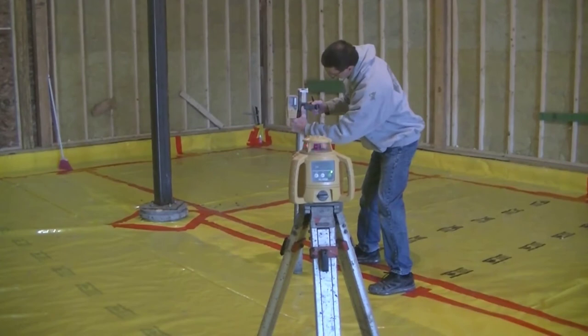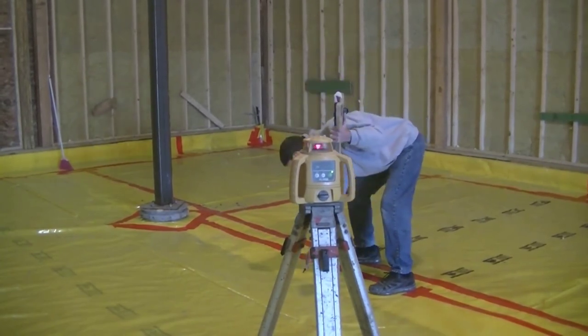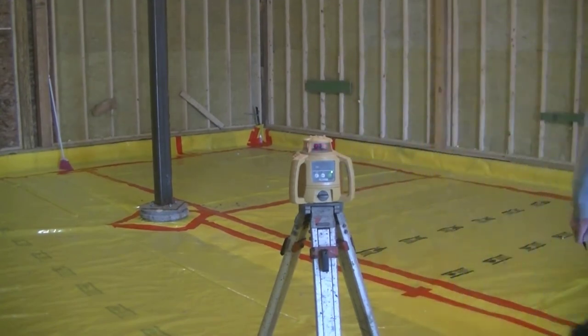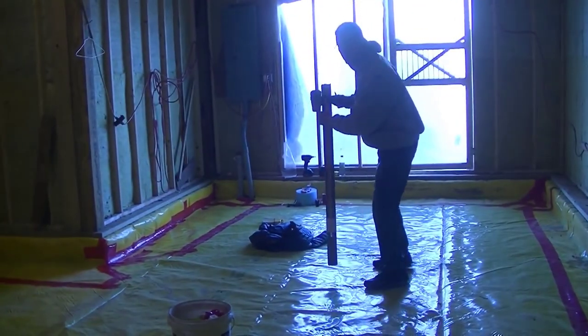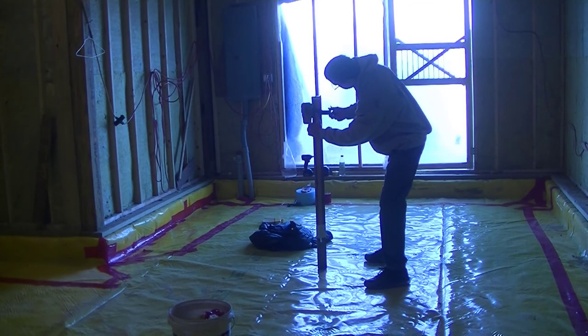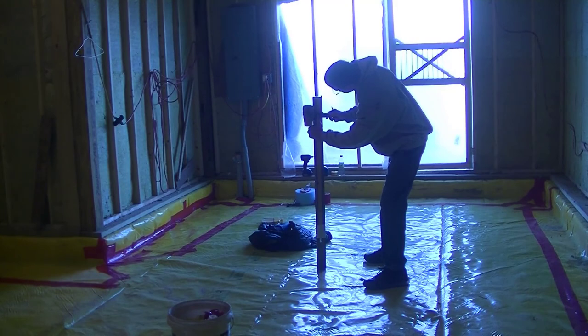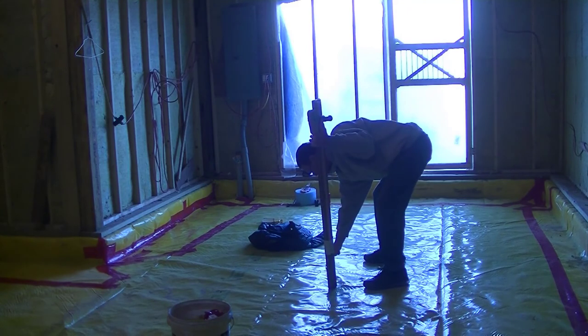When I finished shooting my grades, this floor figured around 16 and a half to 17 yards at four inches. But it ended up being about 21 and a half to 22 yards because of how thick the sub-base made it — they just didn't put enough material in before they put the poly over it. So they're going to end up paying for an extra four and a half to five yards of concrete.